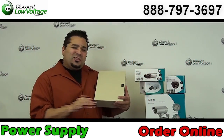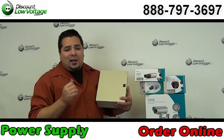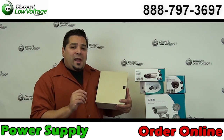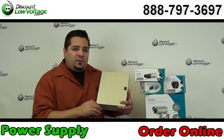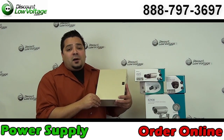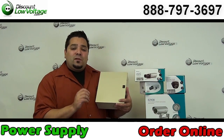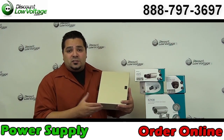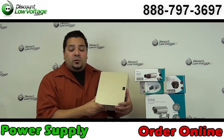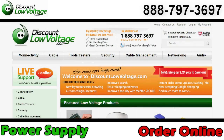Now the power signal, 1,000 feet, it's a pretty good rule of thumb that's out there on the market, even though the RG59 coax signal is about 500 feet, so you're probably not going to have an issue with power. It's really going to depend. It's one of the things you might need to play with, but it's not a very common occurrence at your install, so it's probably not a big deal. You're probably not going to bump into it. But the 2-conductor cable is very easy to wire. Anybody can do it. You guys got it.